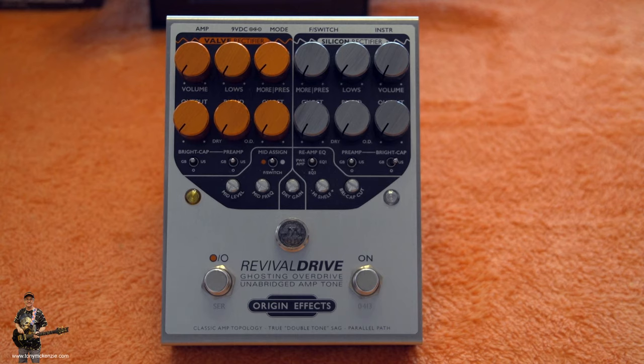Yeah. I always used to hear the wolf tones, the Hendrix wolf tones, particularly when he was cranked. Those are the sort of tones I like myself, but you know, that's what this is about anyway, ghost tones and not wolf tones. These dissonant ghost notes appear to be completely unconnected to the true note, but in fact they relate to the sum of differences between the frequency of the power supply and the frequency of the notes being played, hence that 50-60 hertz thing on the back.